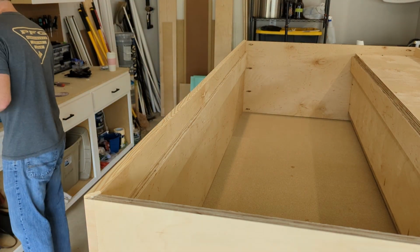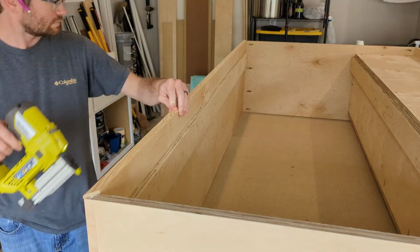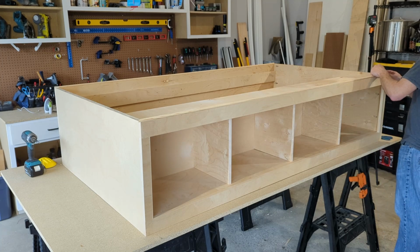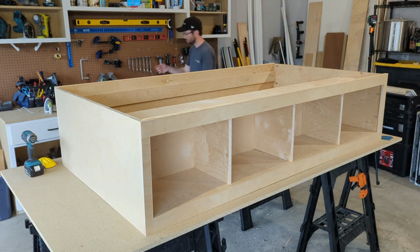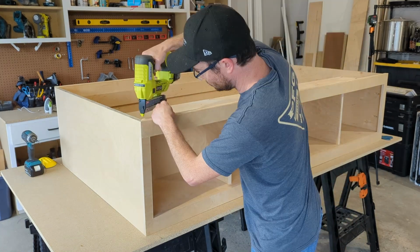It's not the same material as the plywood, just keep in mind that it will take stain differently than the surrounding plywood if you're planning on staining the bed. I'm planning on painting, so it makes no difference for my piece. I attached the trim with glue and brad nails, making sure none of the nails were left sticking out of the top.